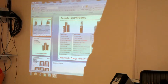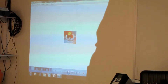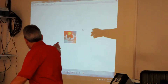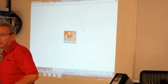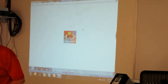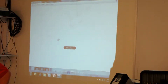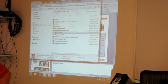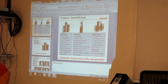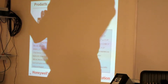There are companies — I pulled this off the internet — that make grounding rings. That's a grounding ring. A split ring goes around the shaft and it allows you to ground that shaft, preventing that bearing from being chewed up. They're called grounding rings. Honeywell does not sell them, but I went to the website and pulled a couple pictures off. A grounding ring just goes on the shaft and they have a split for it.